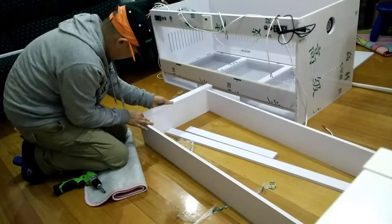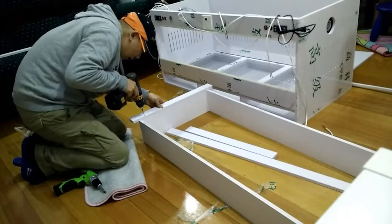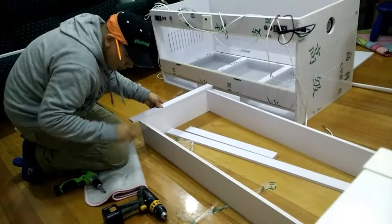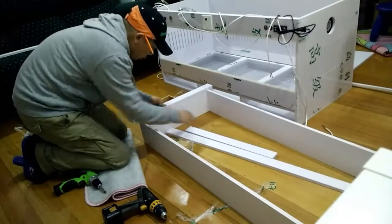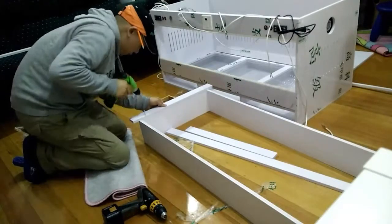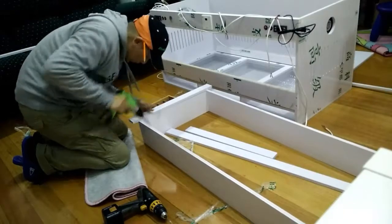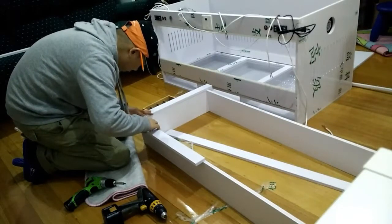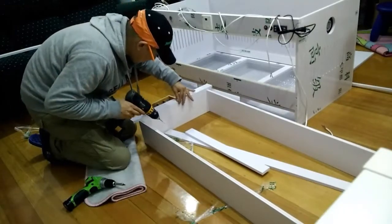Happy with that. Once again, if there's two people, it's easier. And then of course we'll just go boom. And you know it's 14 mil. I mean, just estimate. Just drill past the top board, not through to the bottom one. If not, it's not going to grab. Use the super long screws. With this, look, you don't have to put too many screws, I reckon. Yep, that is fantastic. Three screws is more than enough.